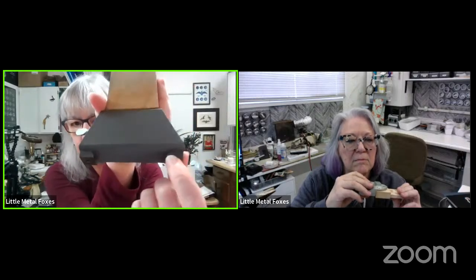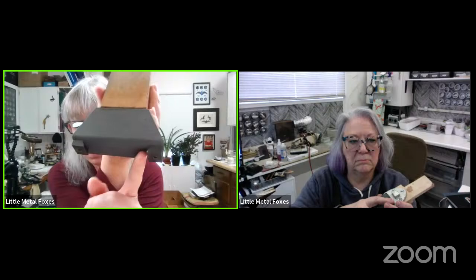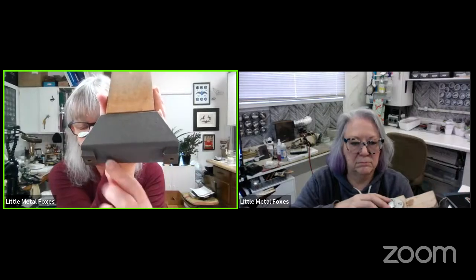And Julia's got one there. I was just going to grab it so people can see. Mine is a little wonky, and it has a lot of sawdust on it. You can see how these bolts here have angles. It's a dovetail cleat. What's bolted to the front of my bench has the same shape angle going the other way, and so this just slides down.